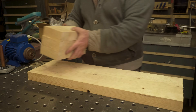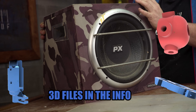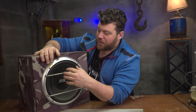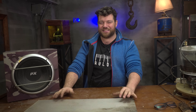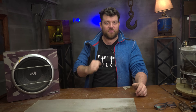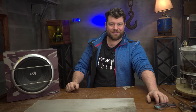I fix everything in place with screws and it spins freely. I also add some grease - that's a great idea. Now let's take a copper tube. I chose it not only because it has the same dimension as the inner diameter of the ball bearing, but also because copper can spin much easier on stainless steel - there's a natural low friction point between the two materials. This copper component is also used to pull back the pitch angle changer of the entire project. Let's take a very heavy solid wood base and mount a huge motor. I'm using a 500-watt subwoofer - it's impossible for me to fabricate something so precisely made, with a perfectly centered paper cone and magnet.